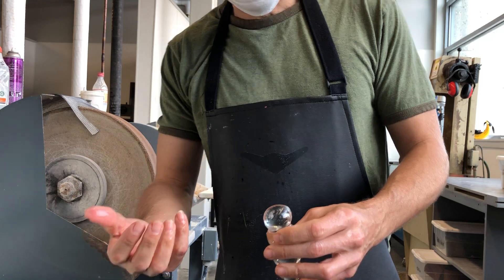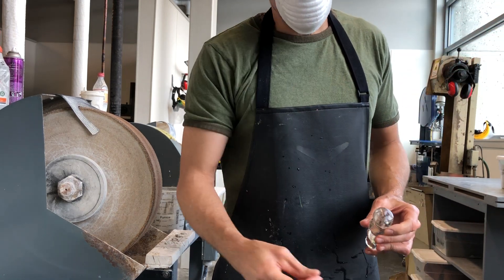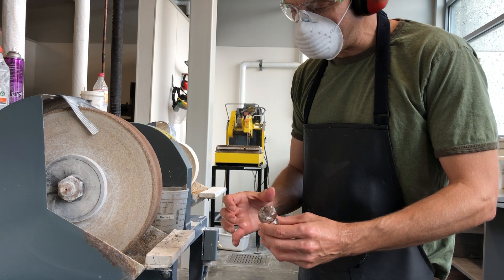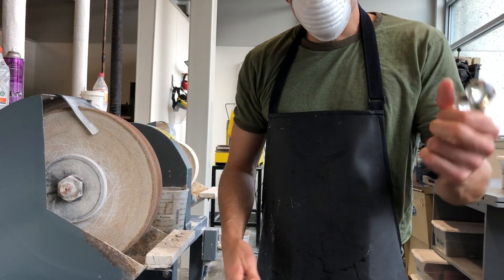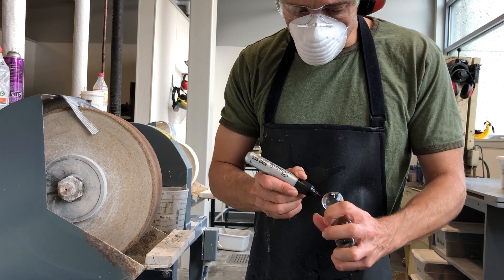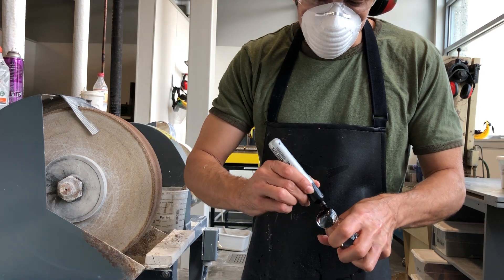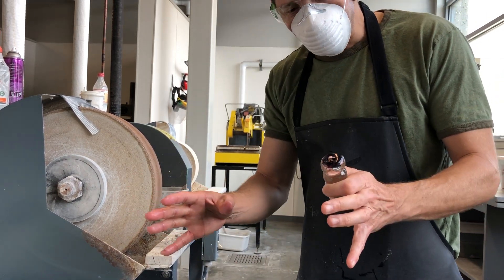I would have to work on that a little bit more, keep going until it's all perfectly polished. The better I do my job on the belt sander going through all the steps correctly to get to pre-polish, the easier this step is. This step literally should take a minute, minute and a half, depending on the size of the object you're polishing. Now I can still use my Sharpie to keep track of what I'm doing — Sharpie up all the fuzzy spots. Sharpie won't hurt the cork. Sharpie all that up, go on, remove the Sharpie, check it, see where we're at, dry it off, Sharpie it up again, go on and remove all of it, and then we'll get to polish.